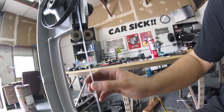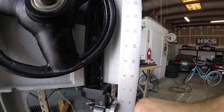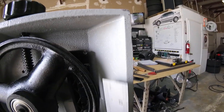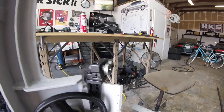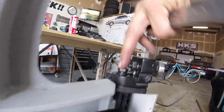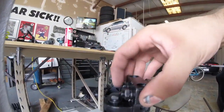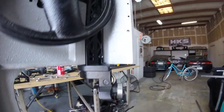As far as adjustments, I think that guide needs to be pushed back some so it's closer to the pulleys. I think I'm going to start there. These things, you adjust them with this one bolt here. They move all directions with that one guide, so you can kind of screw it up if you're not careful.